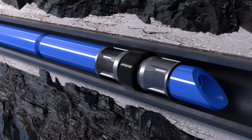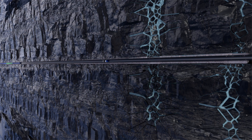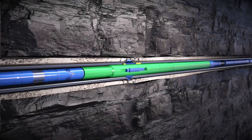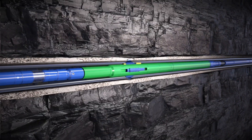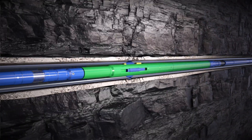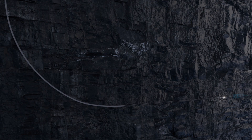The newly fitted frack plug is pressured up, and once again the tool is tripped up hole and the setting tool is reactivated via wireline, engaging the gator perforator to perform another cluster. This series of operations is repeated until the frack stage is complete, and the tool is returned to surface for another frack plug fitting, while the newly completed stage is pressured up and fracked.